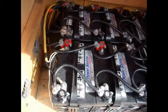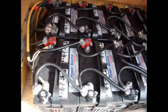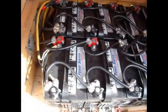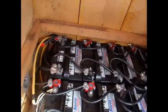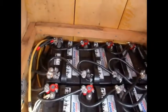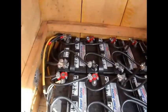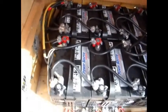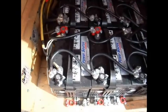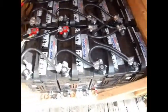You can do that parallel with as many batteries as you want. This is a 12-volt system with parallel batteries. You can also series these batteries — you take those four and connect positive to negative, back to positive to the other negative. If you series two 12-volt batteries you get 24 volts, series three and you get 36, and so on. It's a whole lot more complicated.